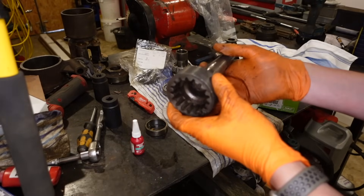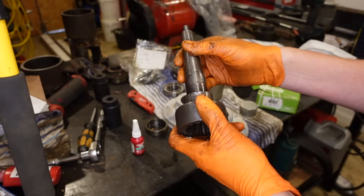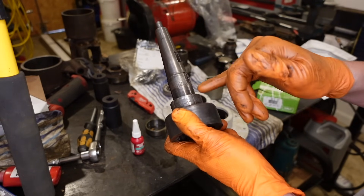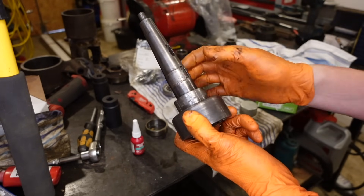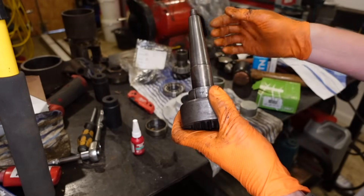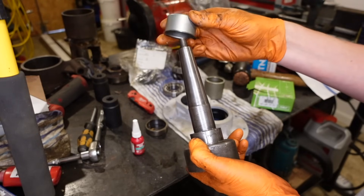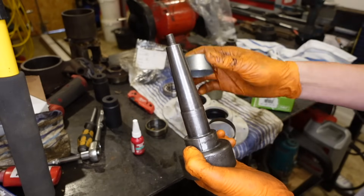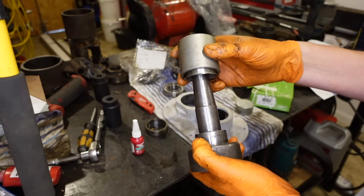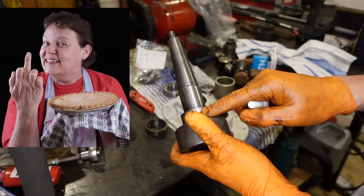So this is one of the final pieces to go back in on the PTO gearbox. This puts the drive through to the main gearbox and the engine connects to here. What I didn't realize however when I was taking apart was that the bearing face and the seal face were two different dimensions, and as I used a bearing separator it clamped in and it scored the sealing face. Now it's quite pitted anyway as you can see, so something needed doing. What I've done is I've got a speedy sleeve — an SKF speedy sleeve — here from Bearing Boys. Here's the sleeve itself and this is the tool. I can't use that tool to fit it as-is, so I've got a sleeve from my bearing kit and I'm going to push it on, and I'm also going to put some Loctite 603 on to stop it from leaking past those bits there.